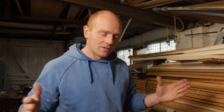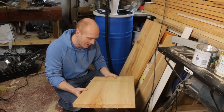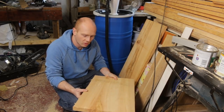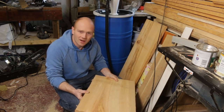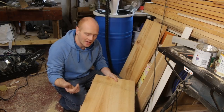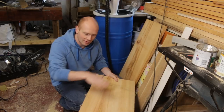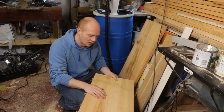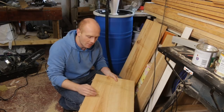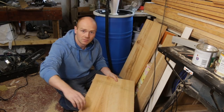All of the stuff I need is kind of less than a meter long, and I think putting stuff through the planer is going to be much easier and more manageable if we can shorten them first. The maximum width our planer takes is 300mm — 12 inches — but I'd rather keep them to probably even half that. It's easier on the planer and there's going to be less to take off. If there's a big cup in a 12-inch board we're going to have to do so many more passes, and all the stuff I need is only about 50mm battens really.